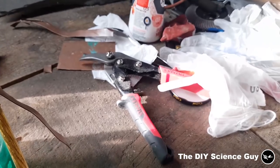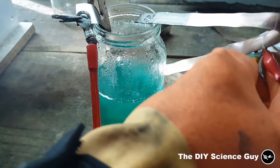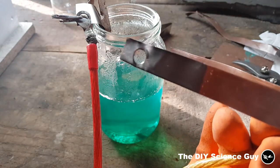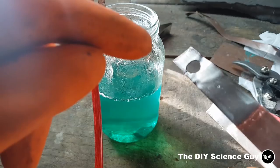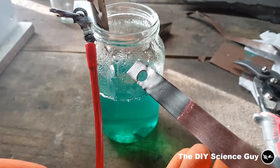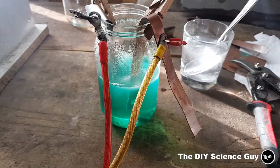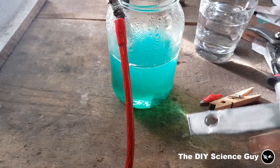Okay it's been one minute — let's see how it did. A very nice layer of nickel. You can see the sides — I'm not sure if that's nickel or just copper. The back side also has nickel on it. But you can see there are parts which do not have nickel on them, so let's put it in a little longer. I flipped it over since one side looked a little thinner. Now it's completely coated — there's no copper to be seen anymore underneath.